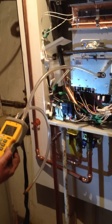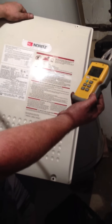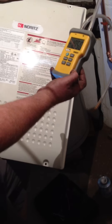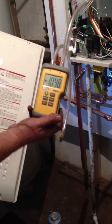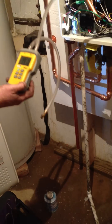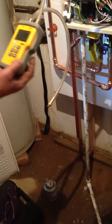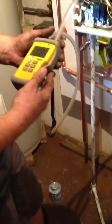As you can clearly see on this label, the minimum manifold pressure is 0.8, maximum is 2.7. So we're looking pretty good — that's 1.05 while the unit's running. It revs up a little bit every now and then as the unit demands more gas. It looks pretty good.